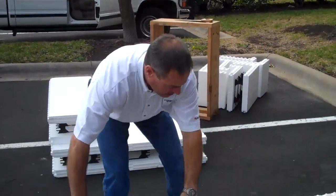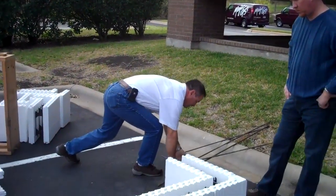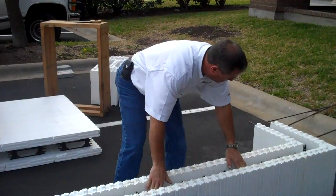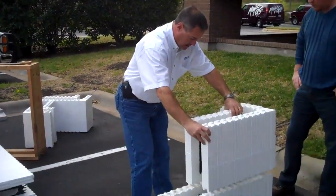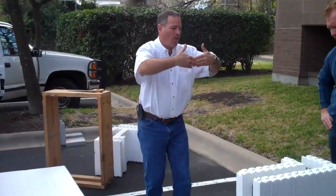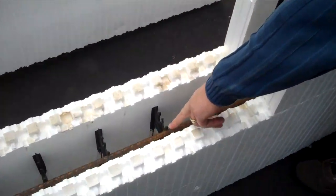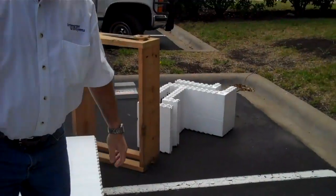We'll continue to build the wall out, dropping rebar in as we go, and they'll tie into that little black piece you see in the middle — that's basically the same as wiring the rebar in. Now we'll put the next corner on top, which has a longer leg and gives me a running bond. You want to stagger these a lot like you would laying a course of block. Exactly — that way we don't have to tie anything together; it's going to tie itself together so the wall won't push when you put concrete in it. Look at the way the rebar is tied in here — it just pops right inside these channels, it won't come out. So you don't have to tie them in after that. No wiring required, and that meets code.